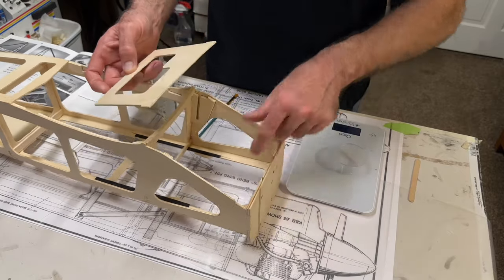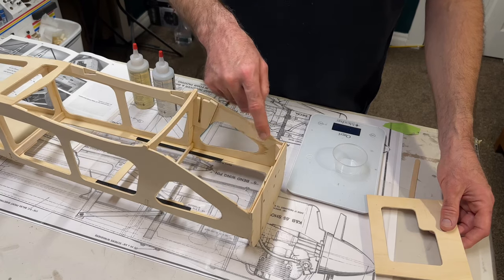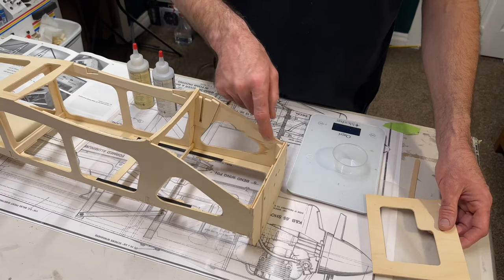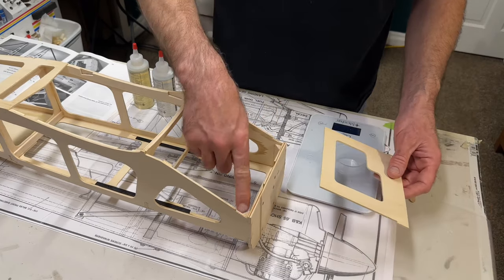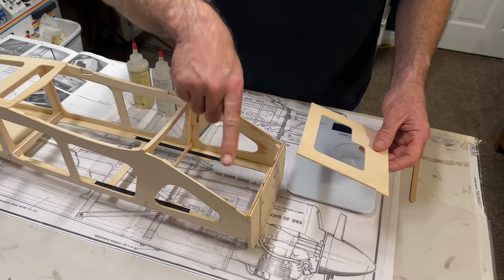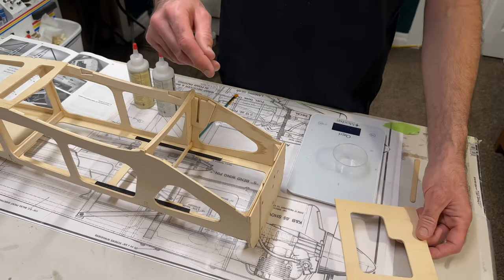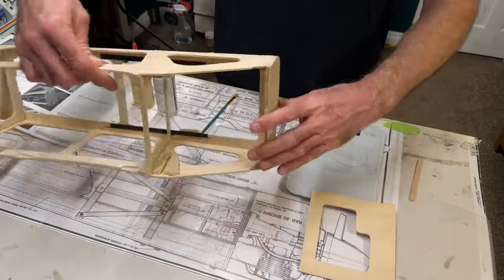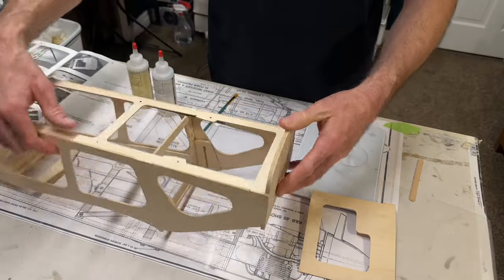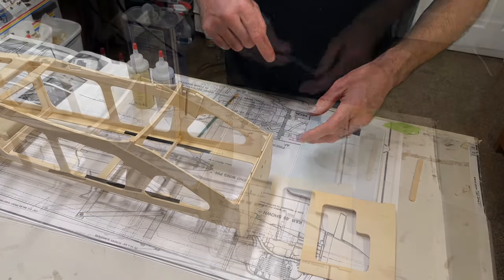And if I have epoxy all the way up here, I'm not going to be able to use CA to glue it on because it won't penetrate the wood. There'll be an epoxy film there. So let's just start with the inside upper half, what I can't get to with this on. So we'll do that. And then when I flip it over, I got all this area in here I can get to. So that's what we'll do. I'll mix up a small batch to do that.